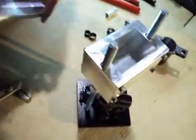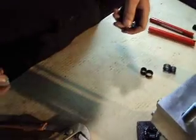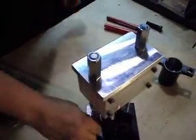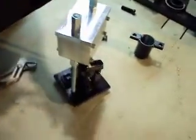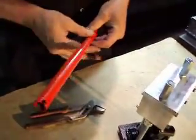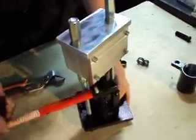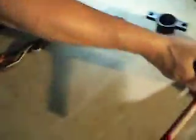So there you go — you put whatever you're pressing inside there. Put your top plate on. I don't use wing nuts; they're really too thin, they don't work well. I prefer to use these coupling nuts — they cost a little more, but they're going to last you forever. All you've got to do is screw them down by hand; you don't have to tighten with a wrench or anything. And you're in business ready to go. So you close your valve. This handle is made to go together — put the large part into the jack — and you pump it until you've pressed it to what you want. That's how these presses work with the jack.